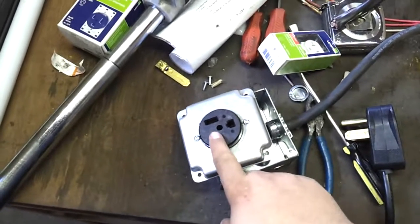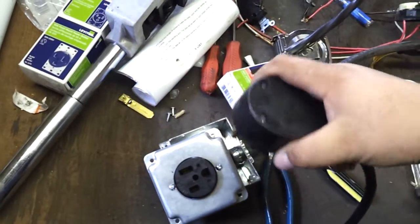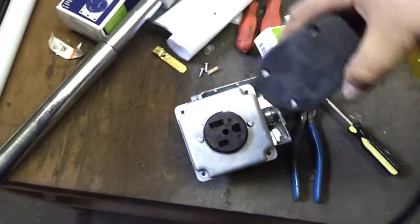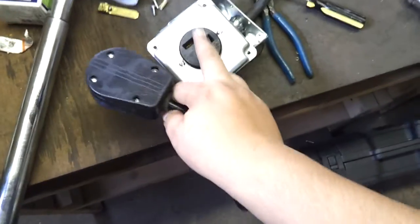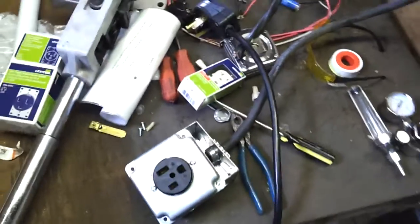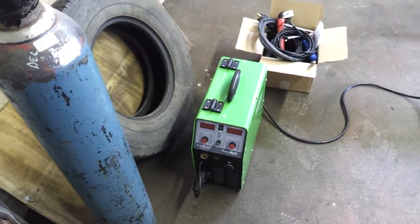One last thing — the orientation of your plug. The ground here, make sure it is lined up just the way I have it here, because this plug is directional. It's not like the wire comes straight into the plug — your ground is at the end of your wire. If you have this backwards, your wire is coming in at the same direction as the other wire and it's awkward, it creates a bind. Make sure that the ground is at the side where your wire is coming in and you're good to go. Subscribe to my videos — I've got a lot more to come. I'm going to go through the whole process of getting this welder set up, regulator, every little step, as well as a review to make sure the thing works properly.